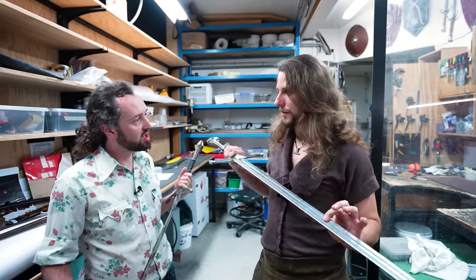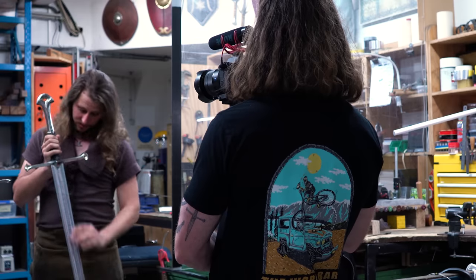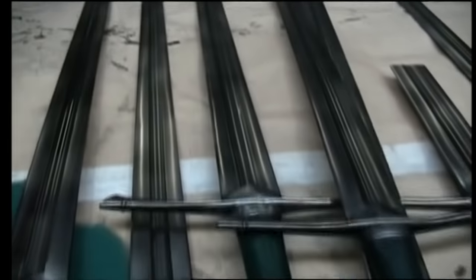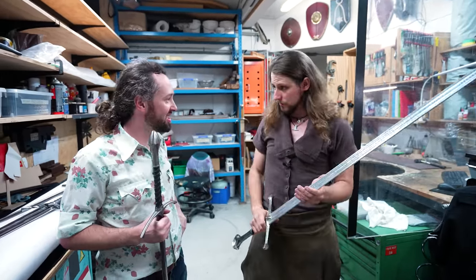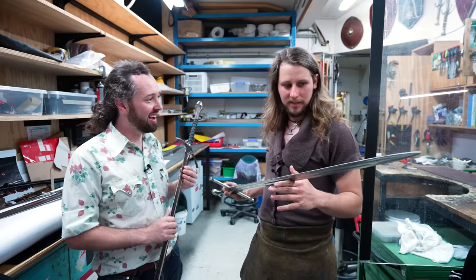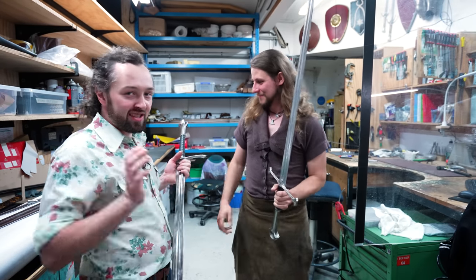Basically what we do is make one of these aluminium blades — it's considerably thicker than any of the steel blades for strength, but it also gives us enough room inside to make a mould. We actually mould the aluminium blades with the hero components on them, and then we can either run a urethane complete blade or throw an aluminium blade in there and cast the hilt around it so it's all urethane. This hardware then goes married onto the steel blade. This allows us to run an armature up the inside using spring steel or carbon fibre. That's the same way we do bows — they've got to actually flex. Getting the limbs to bend the same way and loose an arrow that isn't dangerous is one of the big challenges. You want it to look good and not kill people. A sword is a very efficiently designed object to hurt people — it's almost like that's what it's been intended to do for thousands of years.